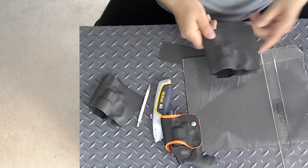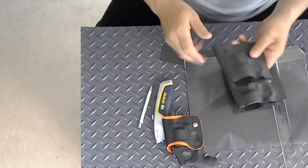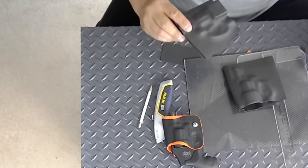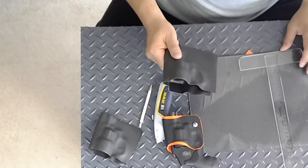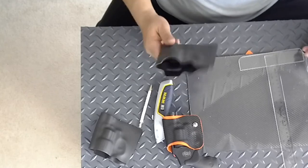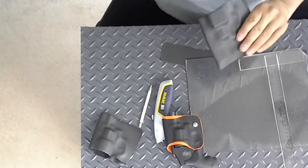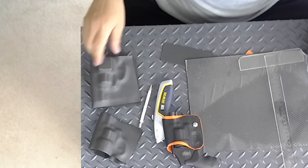And I don't know what's wrong with this material. The gray that I used before worked fine, did it all the same, and everything worked great with it. This one, I thought maybe I got it too hot. Got it to about 330 degrees, and I was like, wow, the texture disappeared. So I had another piece, the last piece that I had, and did it again. And this time at 280 degrees, I could see the texture start to disappear. I hurried in and formed it, hoping that I could salvage it, and it also looks like crap.